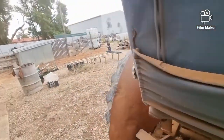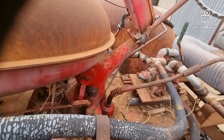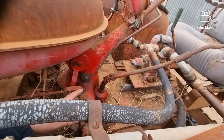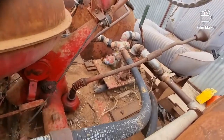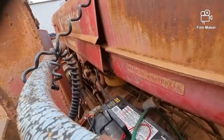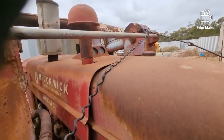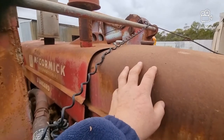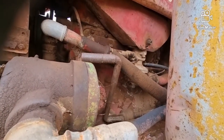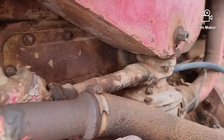It was stuck in two gears - I think someone bumped the gear lever and knocked it all around. Last time I fired it up a few months ago to bring it over here I had to take all this off and pull the gear lever out and get the selectors back in the right spot. Fixed. Choke's down here, updraft carburettor down there, oil bath air cleaner. I do have an inline filter. I've just been running it off a little tank which is your petrol tank - the big tank's for kerosene. I used to run kero on it all the time but we don't do a lot of work with it now, so I'm just going to run it off the petrol and probably wind in that screw on the main jet a little bit to make it run a bit leaner.